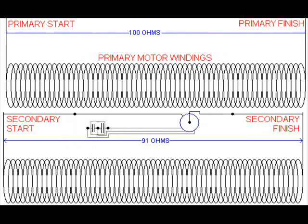This last picture shows how our ceiling fan works. Just to the left of center you'll see a box with two sets of parallel lines — the one on the left is a little smaller and the one on the right a little bigger. These are capacitors — that dual capacitor we pulled out. The switch switches to the one on the left, the one on the right, or puts both in parallel to act like an even bigger one. This is what changes the phase or how much current goes into that secondary coil, and that's how the speed control is taken care of. If you swap the polarity of any of the two windings, they'll go in the opposite direction.